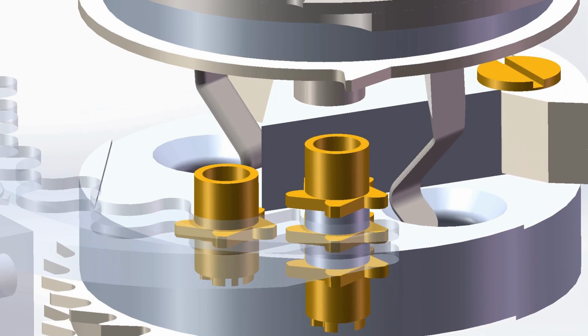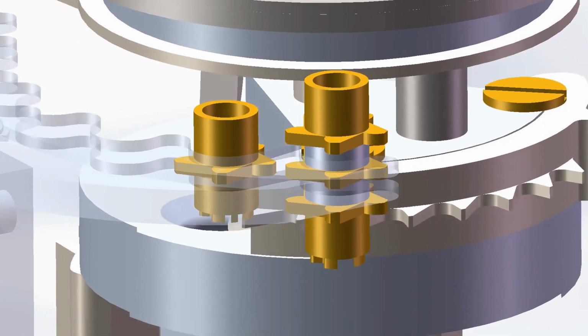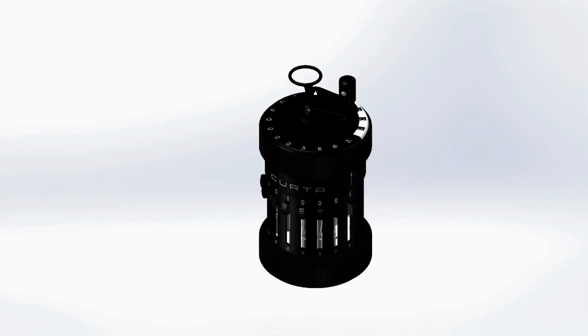Finally, if the lever is set to decrement in subtraction mode, the turns counter increments, as only the top gear in the 3-gear count gear assembly on the first digit meshes with a 1/2 step drum plate. The turns counter is most useful in multiplication and division operations, which are not covered as they are accomplished through the same mechanisms.